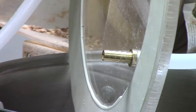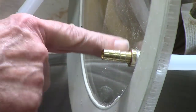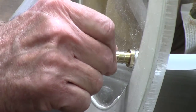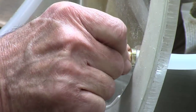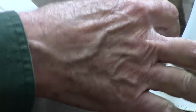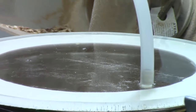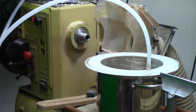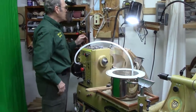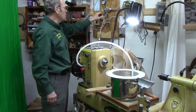Here's the completed lid assembly. I put some weight on it on a flat surface until the glue dried. I drilled a hole exactly the right size for the barb fitting and twisted it on slowly with a drill bit so it fits very snug, sealed against the plastic and held in place by the tube. I've connected the quick disconnect and we're going to run a test vacuum.